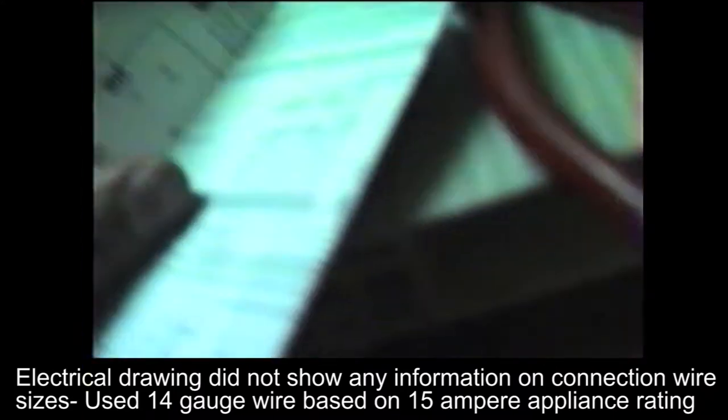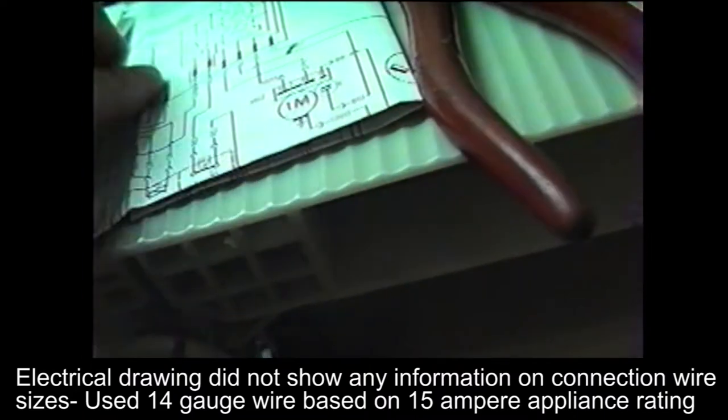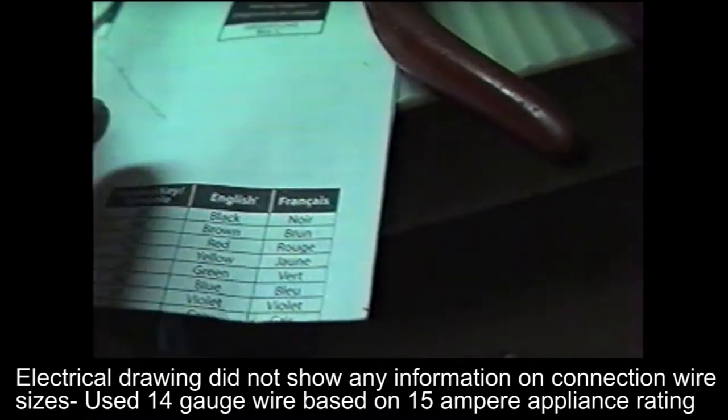I'm going to attach that cord in the distance to the dishwasher and hardwire it. My concern is whether it has enough length. I'll probably have to disconnect it from the outlet under the sink, then mount the dishwasher upright, push it back in, pull the wire out, and attach it to the junction box. One thing to note — on this dishwasher there's a schematic attached. I'm going to pull that out and look at it to see what type of wire needs to go into the junction box. I got the wire outlet disconnected and I'm going to pull the wire from under the sink.